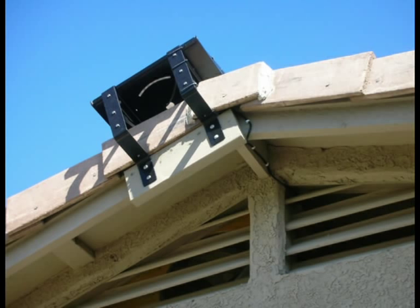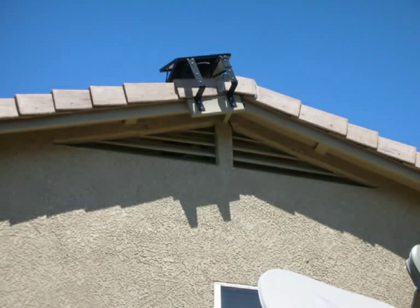The last thing to do outside was just to neatly route the electrical wiring into the existing gable. Here I used some tie wraps and some cable clips. I made sure to include a bend in the wire in order for water to run off before entering the attic. This underneath shot shows the wire routing as well as the mounting assembly. You can notice the top two bolts were a little bit longer in order to pass through both the extension as well as the existing fascia.